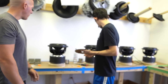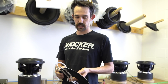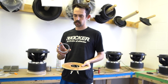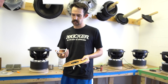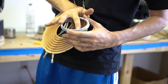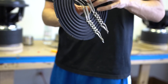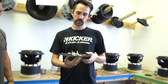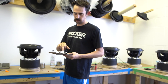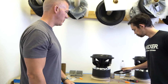So we take a couple of components here. What a lot of subwoofers don't have — and where you'll see triple joint failures — is this ring right here. This isn't something off the shelf; Jacob actually tools these up himself, and there's been a couple of different iterations. It's even down to the fine detail of where the tinsel leads are passing through. That goes underneath and the coil slides through there. That's what's called the triple joint because you've got the former, the cone, and the spider all meeting together — those three things coming together, that's how they came up with the name triple joint.